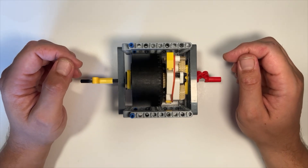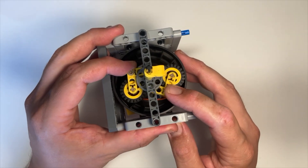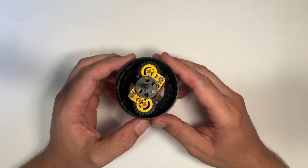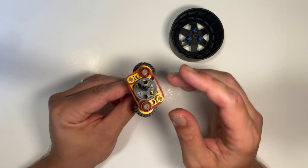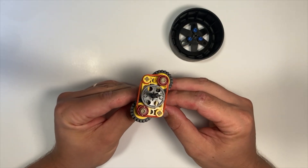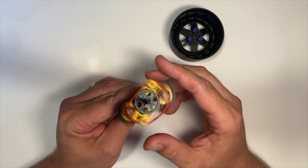Finally, regarding the transition phase, I must again say that I originally designed this as a continuously variable transmission, which means there would theoretically be applications where the clutch shoes would be dragging on the drum without locking the two together. How efficient and desirable it is for the clutch to drag on the drum is largely dependent on the design of the clutch. Keep in mind, I built this using LEGO, and it took many hours to set up the clutch to engage and disengage at the right speeds. But much more is possible in the real world without the limitations of LEGO pieces — perhaps there are materials, designs, and applications where it would make sense for the clutch to drag for extended periods without locking.